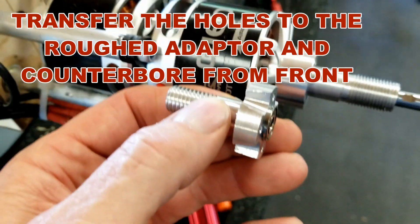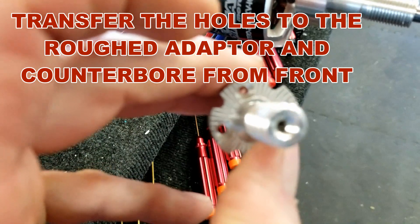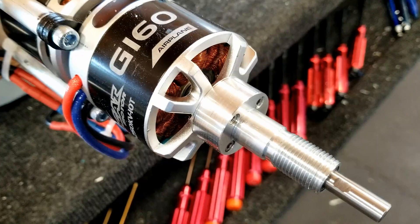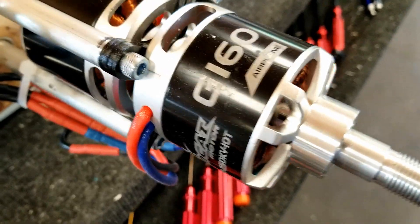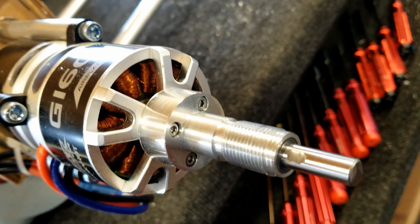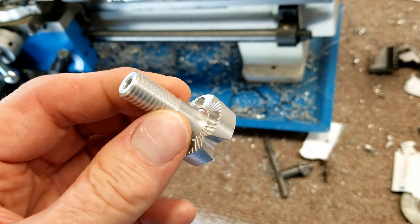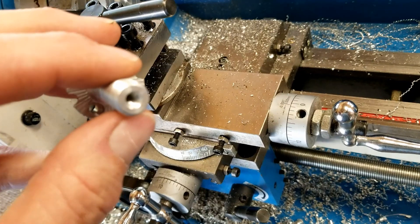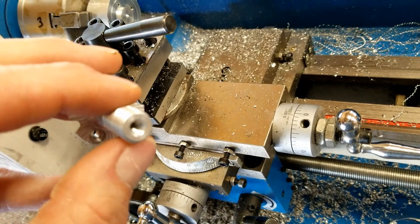That way I could make that right to the back end of the shaft and transfer those holes through — that's how I got the exact alignment on those holes. If you drill from the back end, the mounting surface side, you don't have to worry as much about angle. Because if you drilled from the front, they could be off by a mile. So the new prop adapter — the whole shaft and everything cannot wobble at all; it's got to be concentric perfectly.